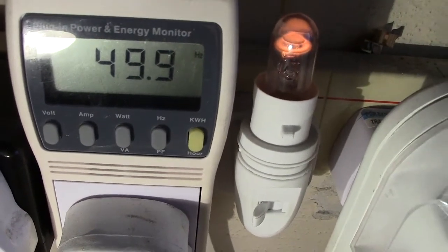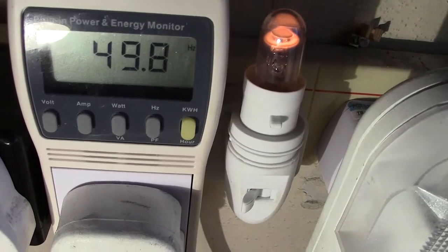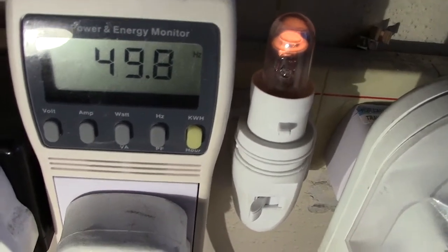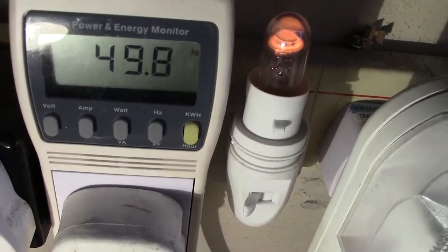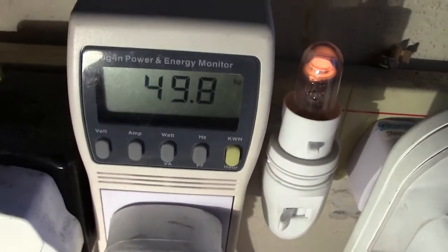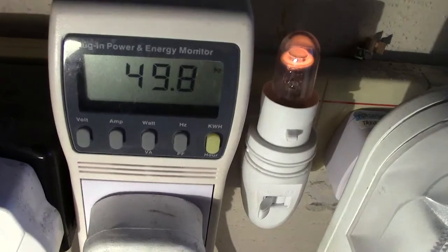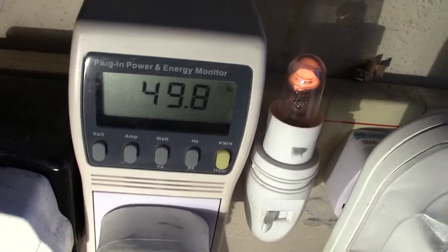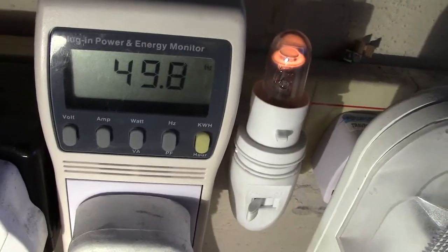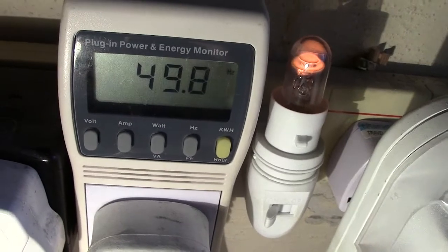Now this frequency also affects things like transformers. If you've got a transformer, say from Korea, which is on 60 cycles, it's our voltage, and just by chance it happened to be a microwave transformer, as was one of mine. I picked a microwave up from a boot sale. It was a lovely job, but it was made in Korea. It had on it 240 volts. I thought, oh, I can use that. But what I missed out was the fact it was 60 cycles, and the transformer was in fact smaller than transformers used on 240 on 50 cycles. So it ended up the transformer tended to get overheated, so I had to change the transformer, put an English one in, or one that was made for the English market. And that microwave served me for many years. It was a beautiful job.